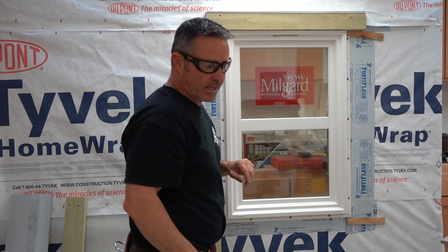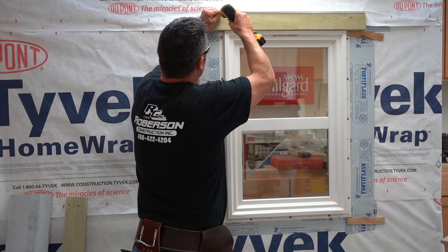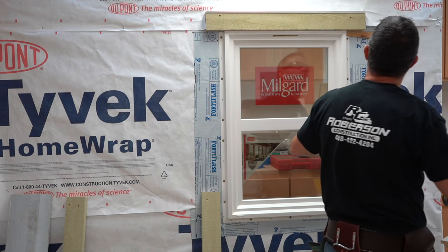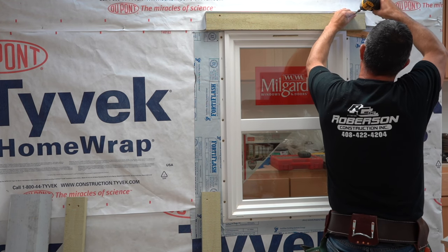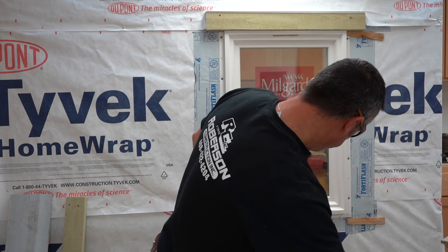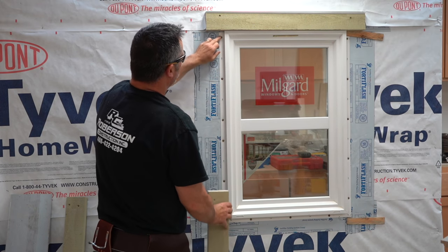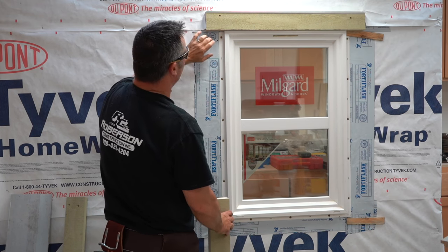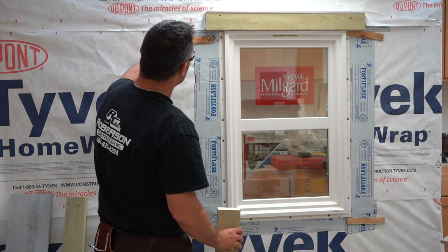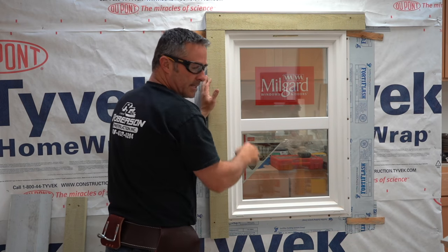For this demonstration I'm just going to use screws. Normally I would use my nail gun with galvanized nails or rust-resistant screws. You can see the flange keeps the board a little higher than the outside, so typically you'd use a shim — smaller on the inside — don't go onto the flange, and then go ahead and set your board in.